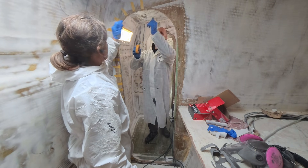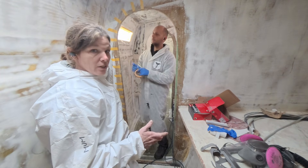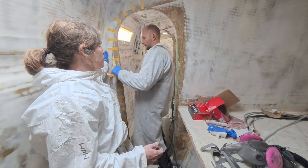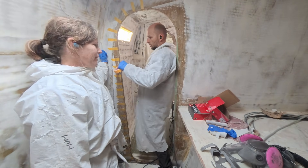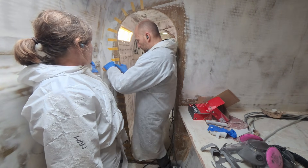This has to be 100% covered. We're going to consolidate just with the tape. You could put it under a vacuum bag, but it's not worth it — there's a lot of faffing around for nothing. Cheaper, easier, and faster to do it this way.